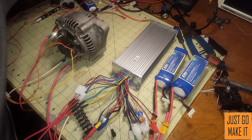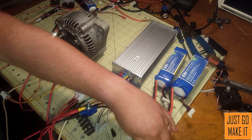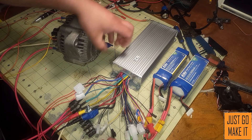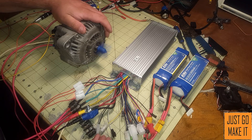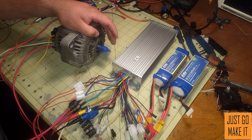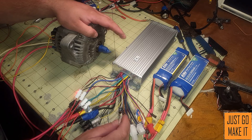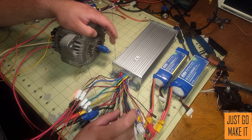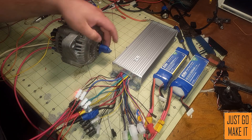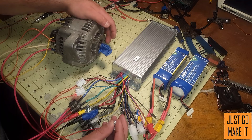To get this going I need to turn my power supply on, so now I have 12 volts going through the field coil. I connect the power and there we go — I've got some tape on the shaft so you can see it, and it works really well. It's actually got some pretty high speed to it. One other wiring thing I forgot to mention: there are two wires that if jumped together will reverse the motor, so for a go-kart you could have a switch for reversing.